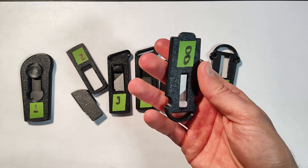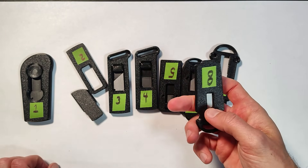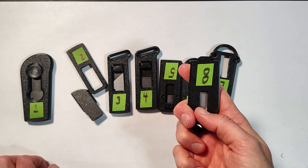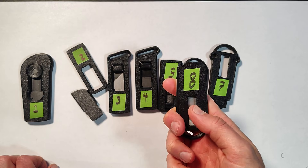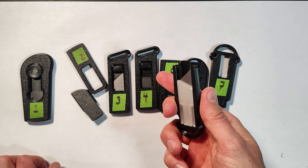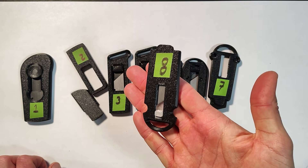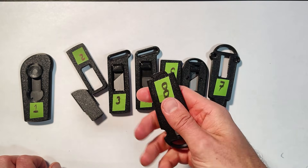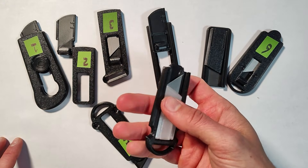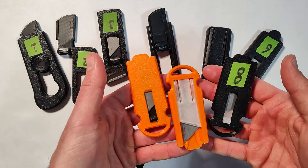...to what ended up being the final design. Thinned out the button from six a little bit, just so your finger's less likely to get in there. Like, you're not touching anything sharp. There's no sharp edges, but even the unsharpened edge of a utility blade isn't the most fun thing to run your finger across. So now these little eye sections become jimping — they really grip into the hand a little bit without digging like that one did. This was kind of the final prototype that ended up becoming all of these.